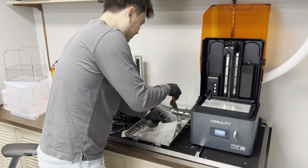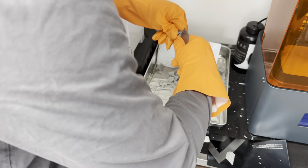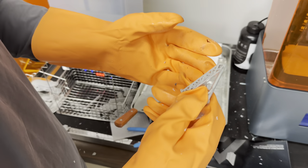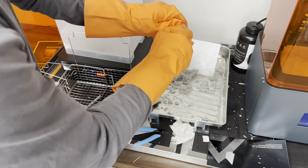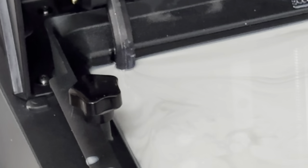Going back to the metal spatula for now. I'm rinsing the last batch of parts and changing into my orange gloves. With parts that have a flat surface where all the supports are attached, it's pretty easy to just take the spatula and sever them. Also with pre-supported models the designer usually takes care to make them easy to detach — so if you get good models it really saves you a lot of time. I can just crack supports off in halves.